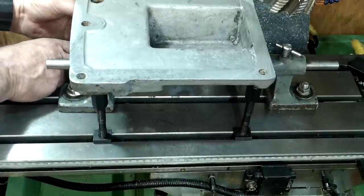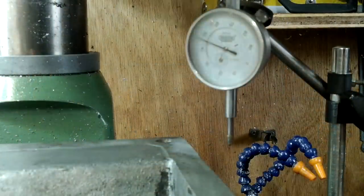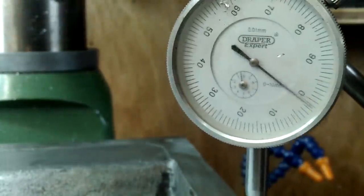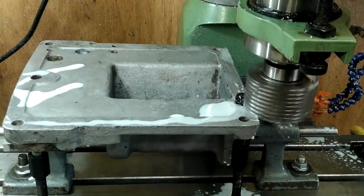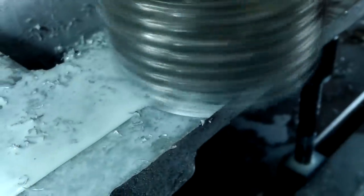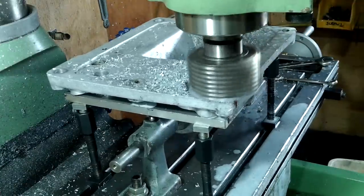The rotational error was shared out between both ends, meaning if there is a 2mm error at one end the opposite must share the same error, so that after skimming there should be two opposing witnesses. A witness is a very small part of the original surface at two extreme opposing ends that are not machined, usually as proof that a minimal amount of material has been removed to obtain the required outcome. While taking a very light skim I constantly check that the jacks haven't come loose.